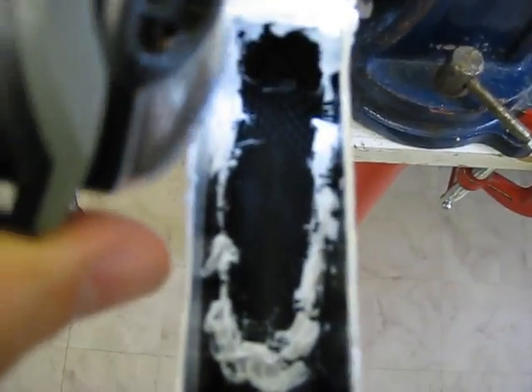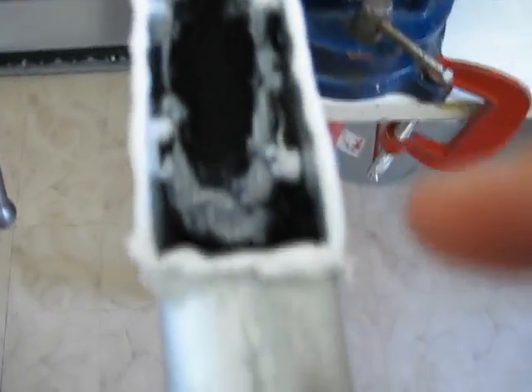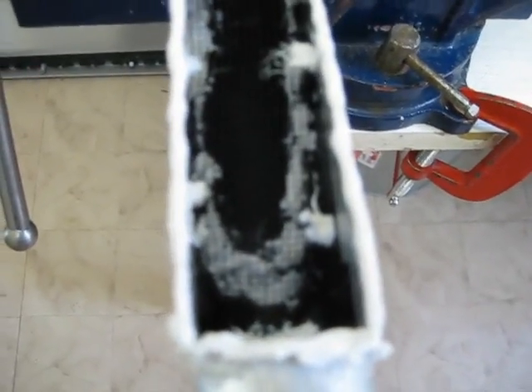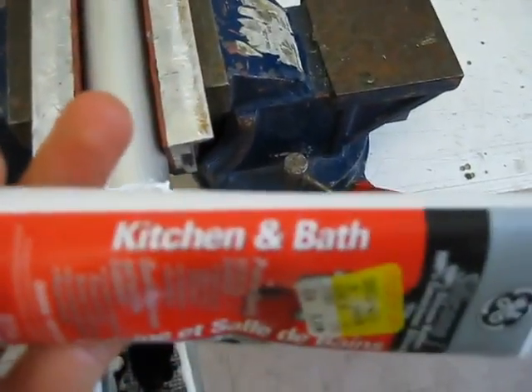Here's the first of the screen layers in place. A little bit messy, but I wanted to plug all the air gaps — you can kind of make out the screen there with the flashlight on it. That's the second screen layer in place. I just dabbed it in with four little pieces there and some more in the front, so it's not touching the second layer but the air has to pass through it. I've also put some silicone caulking all along the edge because when I put the glazing down on top I want it to act as a gasket. I don't really want the glazing touching the aluminum because that would contribute to heat loss out the front — sort of an insulator.